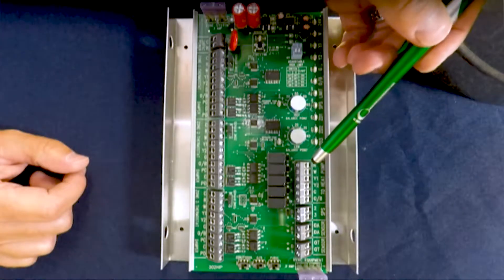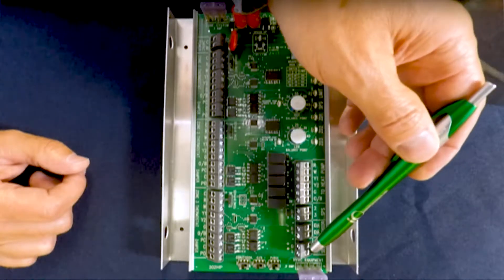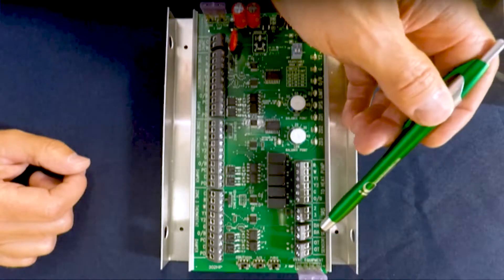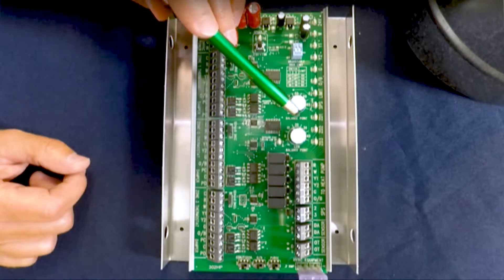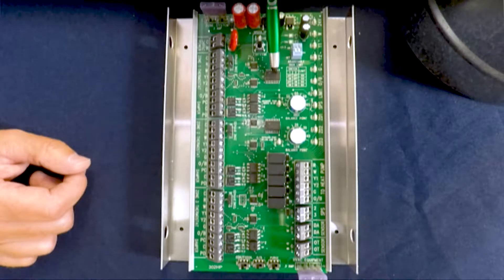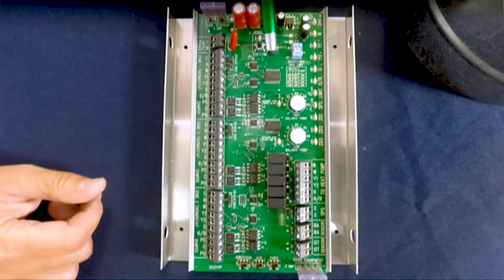On the far side, this is where your equipment wires in, and then your static pressure control sensor — the two wires here — your discharge air sensor, and your outside temperature sensor. Since this is a heat pump compatible panel for heat pump dual fuel, you'll wire in your outside temperature sensor there. Always wire in a discharge air sensor. These two large potentiometers are where you dial in your high and low balance points. This little blue box has switches that let you set your high limit on the system. The low limit is already in the microprocessors inside the panel — we set that at 45 degrees. If the air temperature gets to 45 degrees, it shuts the AC off and circulates the fan. On the high end, if the furnace is running, we shut the furnace down and run the fan to either cool things down or warm things up. You want to use our panel to trip the limits on your system rather than the actual equipment limits being tripped.